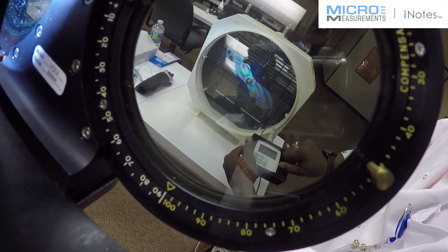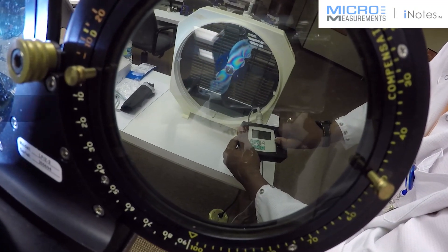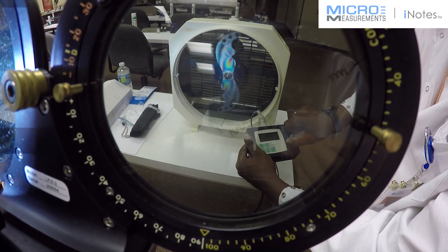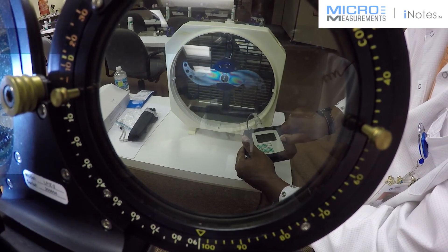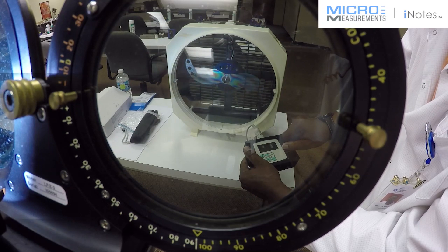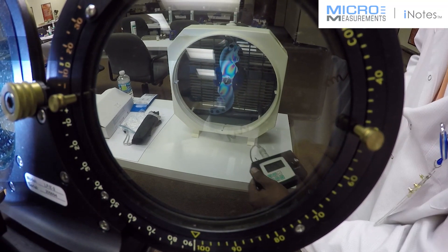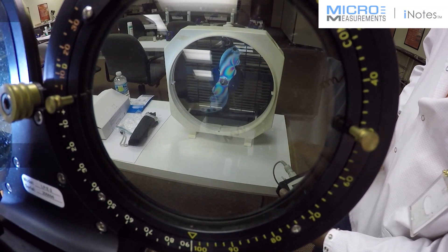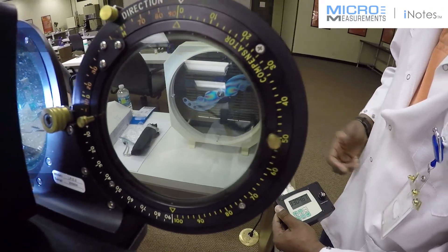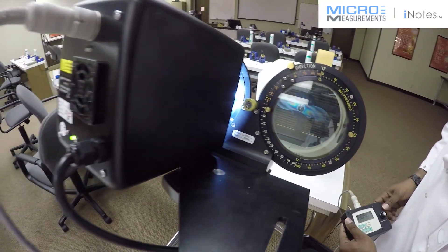If I go too fast, obviously the fan blade will speed up and I won't be able to make that visual observation as easily as I'd like. But once I've found the true rotational speed, the fan blade will approach a sense of a static condition — it will basically look like it is not moving, although we know it really is. And at that point, just like any other analysis with photostress, we simply look through our optical lens assembly using our optical transducer called a compensator, and we can quantify all the values of stress that we see visible here.